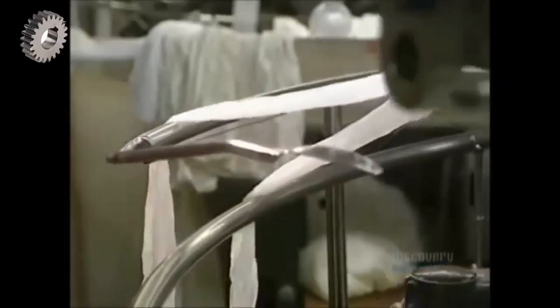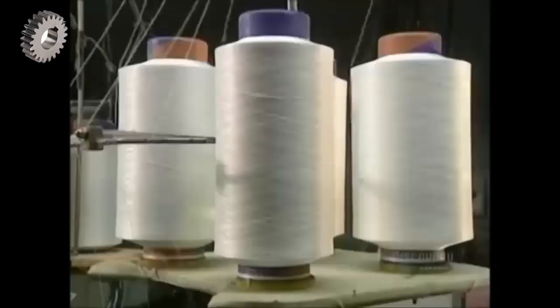The two ends must now be joined. This automated machine assembles the two tubes together to form the pantyhose. Then a scissors cut the pantyhose, a necessary step in production of a pair. This opening is enlarged to allow for sewing, which will join the two tubes at the point of the panty.